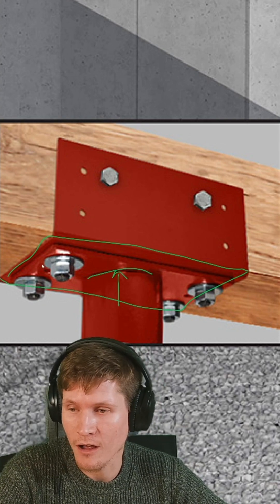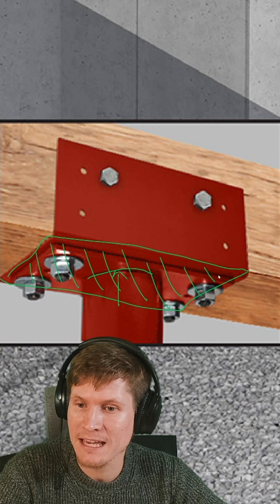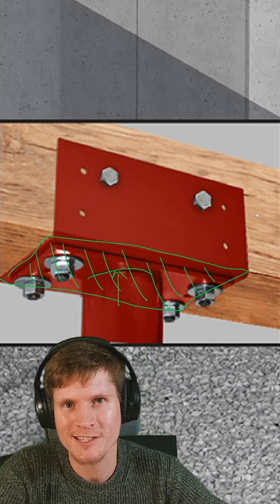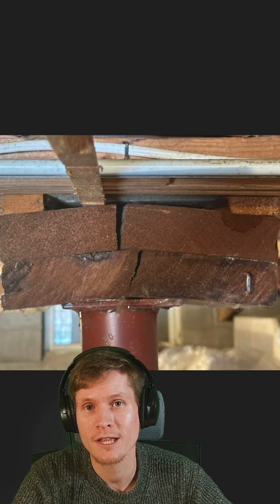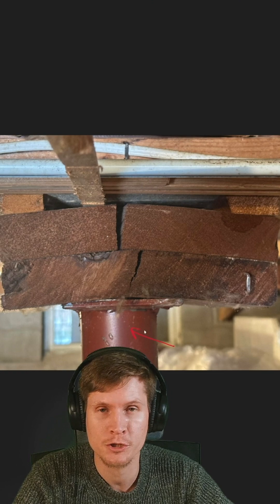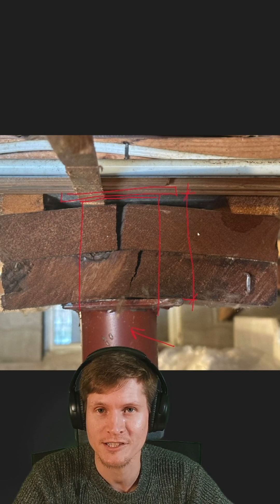The plate is not aiding the steel post at all. Rather, it's providing enough surface bearing area for the wood beam to transfer all of the reaction force down into the column without crushing the wood beam. The best solution they should have done is replace this short steel post with one of the correct height. They instead made up the difference in elevation by packing it with two 2x's flat on their side.